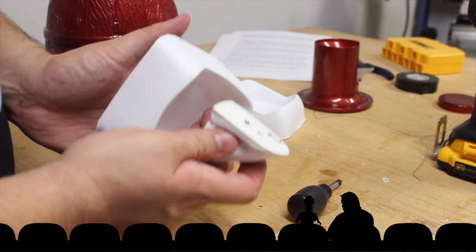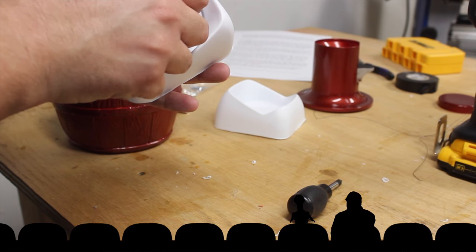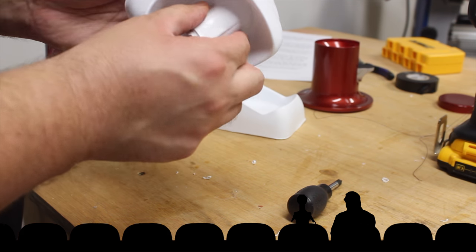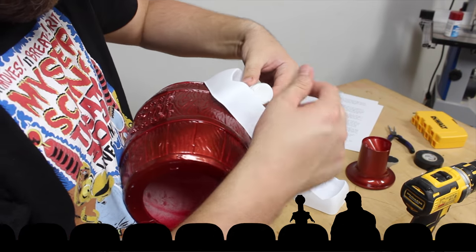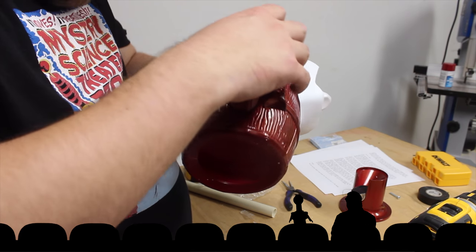Like the paint on the tip of the screws, I use the same method to transfer marks from the holes in the arm pieces to help with alignment of the shoulder pieces. With the pieces marked and drilled, I attach the shoulder and arm pieces to the sides of the barrel, and then attach the engine block to the front of the barrel.